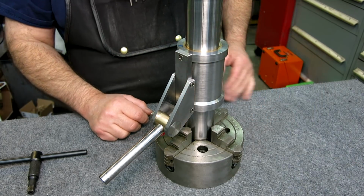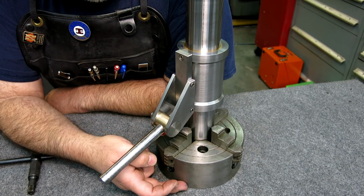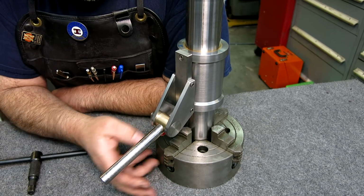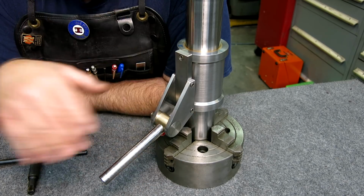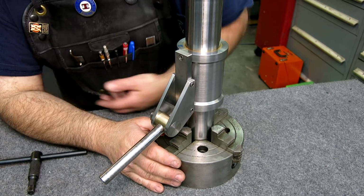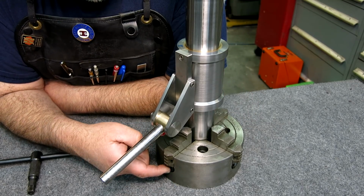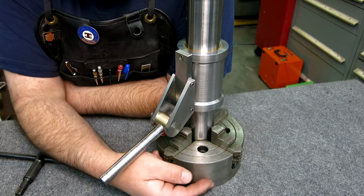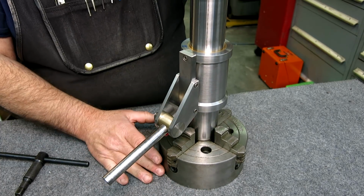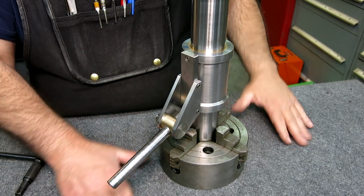Answering a couple of questions. Some people asked why 4 feet instead of having just a continuous rim around the base. Now this isn't the base. It's been sent to the heat treater, so I can't show it to you right now. But the thought behind that is that 4 feet are much easier to correct for perpendicularity, because what we're trying to do is make this pin perfectly square to the surface plate, right?